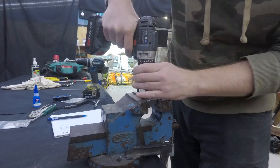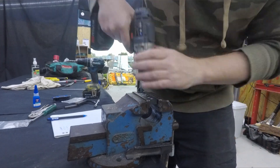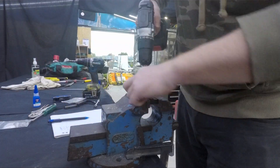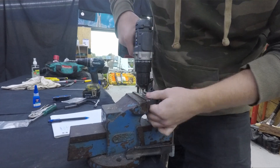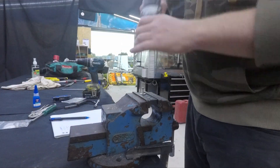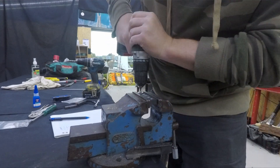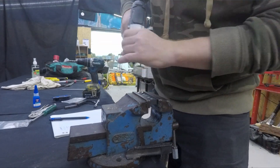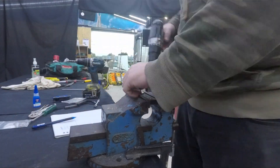There's something else to mention: the brass thread inserts, when they slip, will not let the screw back out. That was one of the reasons we investigated this — we had brass thread inserts where we couldn't unscrew the screws after they were over-tightened. That issue is very repeatable in my experience, although I haven't heard anyone else talk about it, which is quite strange.